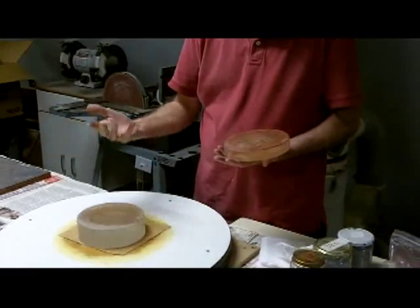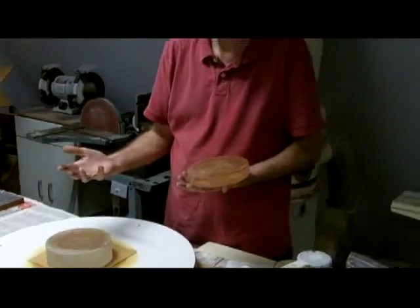Yeah, and when you're working with a finished mirror, it's really easy to do. With a mirror that's in grinding, you clean it off and wet it with water, and then the sun will reflect off the water. It doesn't give as sharp an image, but it gives you within an inch or so of where it's going to be, which is close enough, because we're not grinding something that has to be an exact F ratio. Like I said, we're more concerned about the length of the scope than anything else. So if you get within an inch or so, you're close enough. Okay.